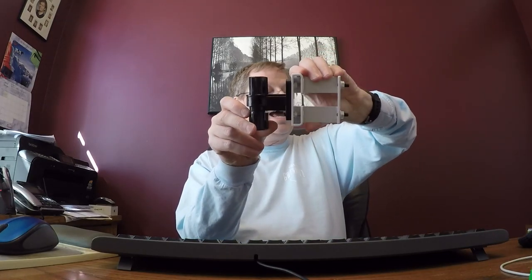So before you start doing the install, if you have a Continuum frame and you don't see these big clamps, they're kind of beige, and it's got the actual belt holders on the end. And the other one has got the great big tensioner with the two knobs on it that's actually going to tighten the belt once we get it installed. If you don't have those in what you have right now, and you don't see any screw holes near the front of the end legs of the frame for which you can screw the clamps into, then I would suggest reaching out to Grace Company fairly quickly and asking them to provide you with the missing pieces. They provided them to us free of charge, so there's no issue there. And it'll save you frustration, like when I got partway through the instructions and realized I had to stop.